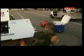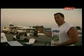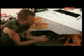So that's what 1,000 amps does — that's why we bring spares. He's going through all eight motors, pulling out the brush carrier on every motor because we had a damaged unit. Nothing abnormal, but he's going to go through every one and make sure all the brushes are moving freely, everything's in line, and all the motors are working correctly.